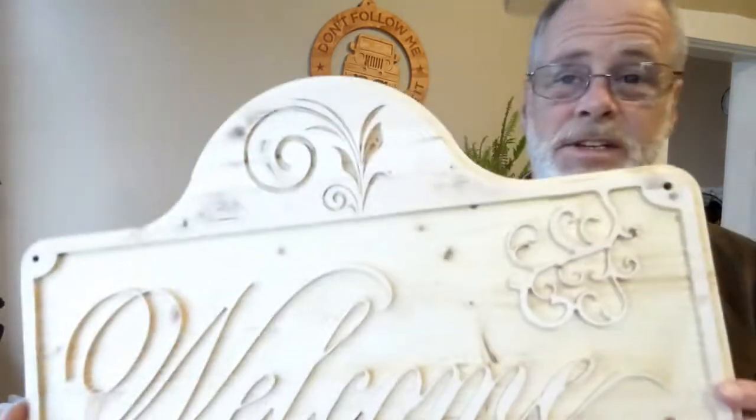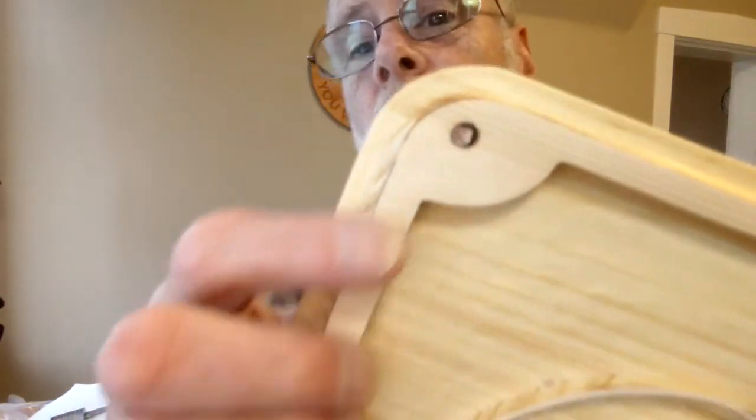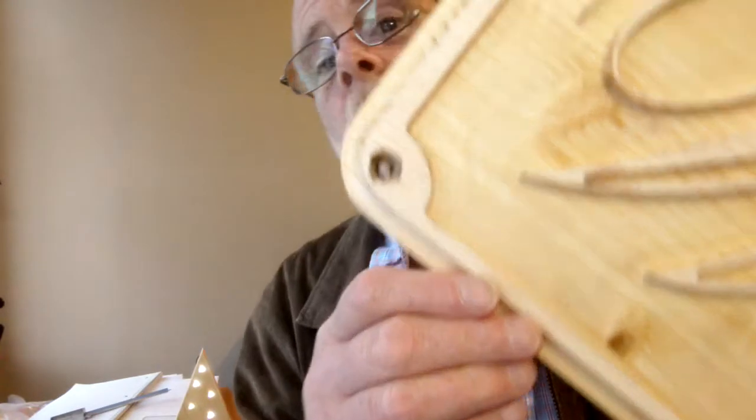Like I did on this sign. You can see I've got a nice clean hole right here, and these two holes are nice and clean, but look at that one. All chewed up. Because I did a plunge drill with a 1/4-inch bit, and the chips didn't give way. So that's why you want a peck drill. Be very aware of the tool you're using. I wasn't using that end mill, by the way. I was using a cheaper version.